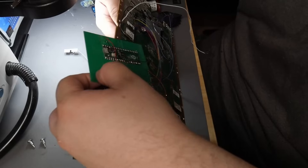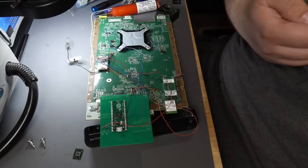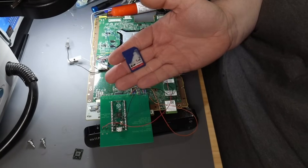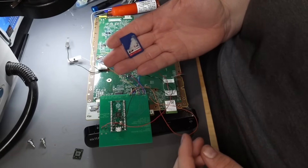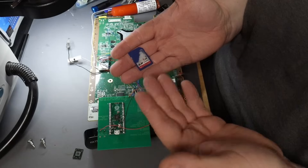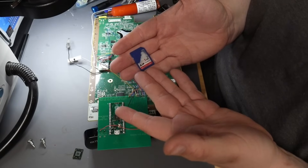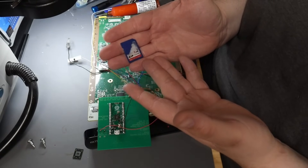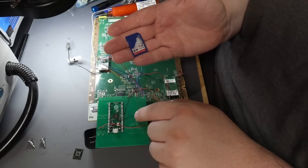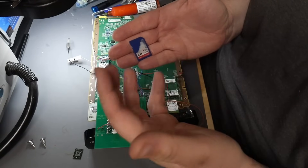Flip the Wii U over nice and carefully. The very next thing you need is a 1GB SD card, and I will leave a link below for the entire tutorial. What you do is write the first couple bytes of the hacked boot one that you want the Pico to glitch and boot off of — that's the whole point of this.